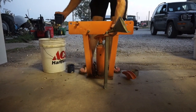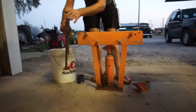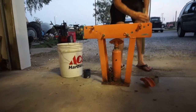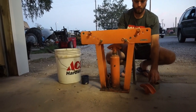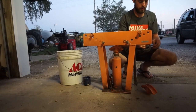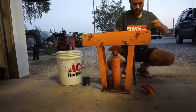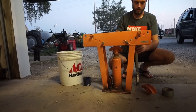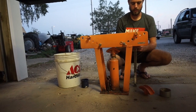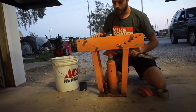Okay, there we are. We're full right up to the top. So we'll clean that off and put another piece of tape over it. And we're shooting for a 90-degree bend. So you kind of just go by look, or by eye, and show you what that looks like here. So I got both ends taped full of kitty litter.